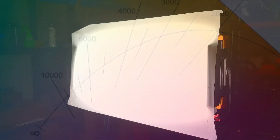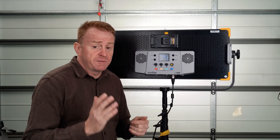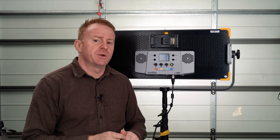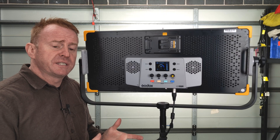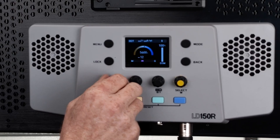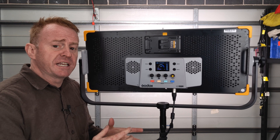When I added diffusion, the centre of the beam became greener than before by about the equivalent of a one-eighth correction gel — but you could compensate with the plus/minus green capability, dialing in some magenta. That brings me to the next negative.